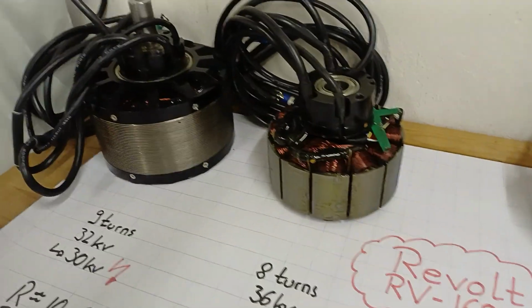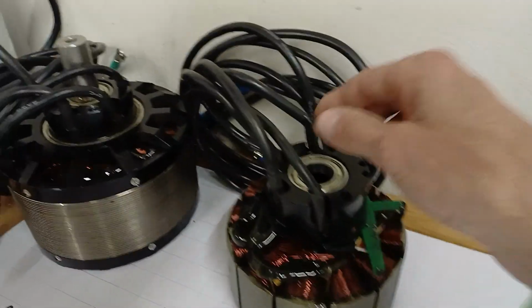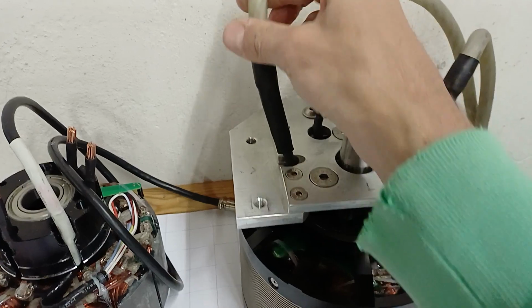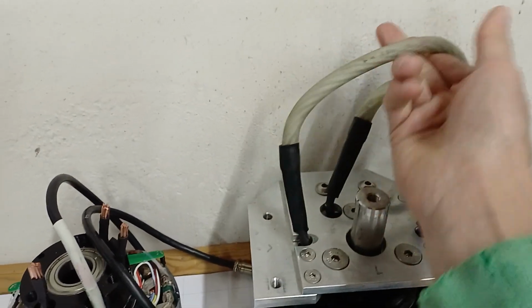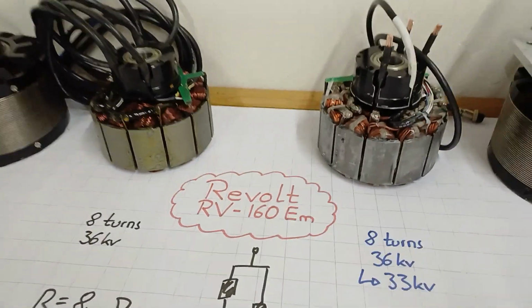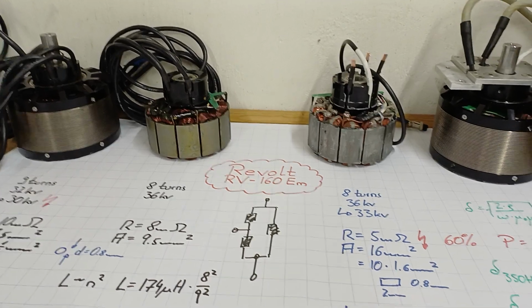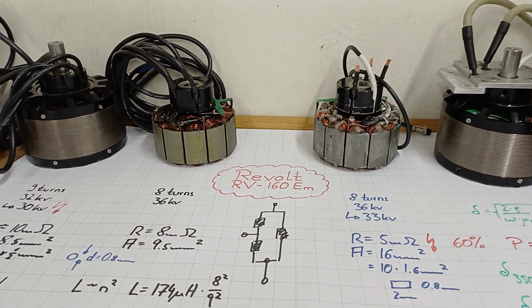What else do we have? I think that's all. I already talked about the outer cables. That is 21 square millimeters. I increased to 35 square millimeters. So also less losses in the cables outside of the machine. Overall, that's lots of theory. The truth is waiting inside of the vehicle as soon as it's moving.